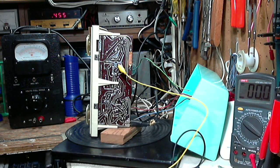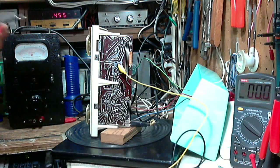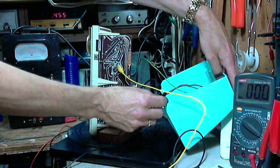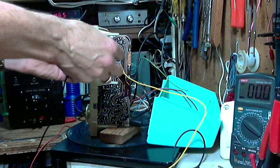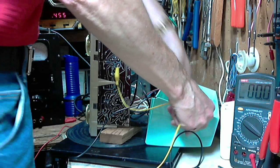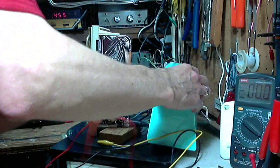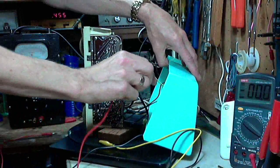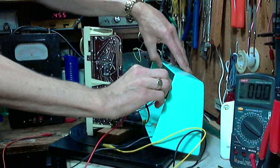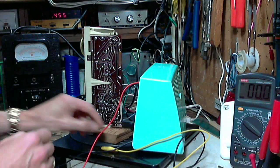No information in the book about how to connect your signal level meter. So we'll put it right across. Oh wow, put it across the voice coil on the speaker. Awkward getting in there. Here we go. It's one lead. We'll connect the other one. I just knocked the signal generator clip lead off, that's all. This wire's worrying me. It's going everywhere it shouldn't. Flip leads. Good.